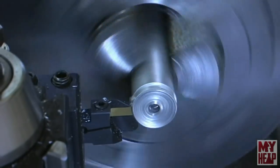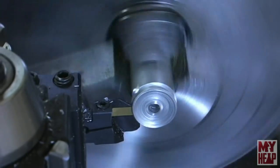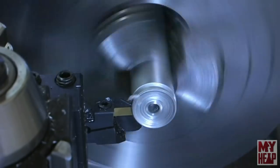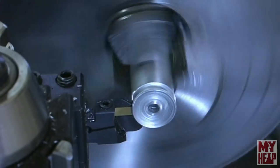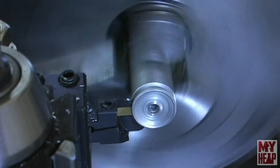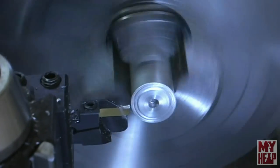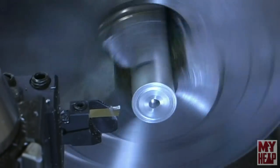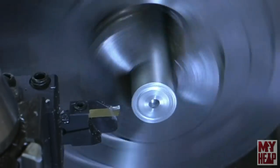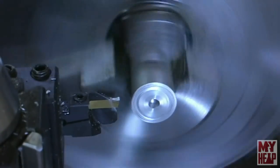Now keep in mind that I only have an Atlas lathe, and an Atlas is a 10F, so it's got a 10-inch swing. It's a pretty lightweight lathe when you consider everything. So, make this first cut dry. And I tell you what, this is feeding by hand. It's cutting real well. Oh yeah, looky there, I like that. Not sure where the wafer went, and I'm not going to dig it out, but let's go in and take another pass real quick. We'll cut off a bit more.